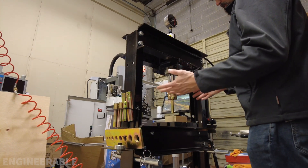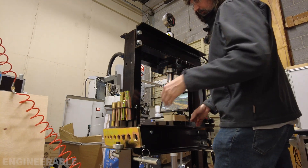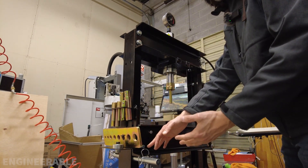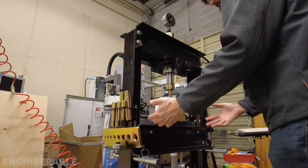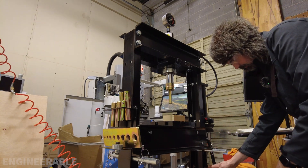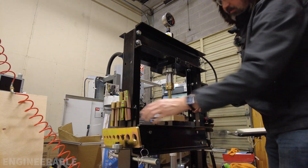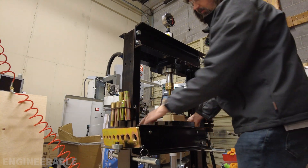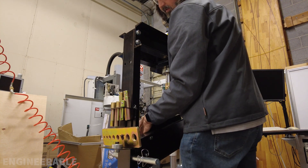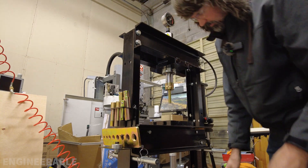One of the issues with these common hydraulic presses, like these 20-ton presses, is that the table is pretty annoying to move up and down. The table itself is heavy, but it's not that crazy heavy. It's more when you're trying to juggle the pins and moving the table up and down. You can take one pin out, bring it down lower, and only let one end of the table down to that pin, then do the next pin. But if you're not careful and you go to tilt the table up, it can fall off that pin and down on the ground — that's pretty dangerous.